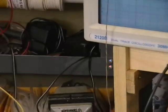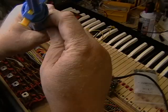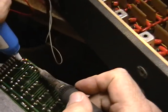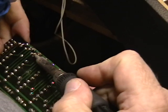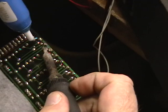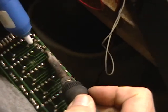I don't have five and six. Since in a flip-flop IC, current for the collector equals beta times IB, and since the oscillator works when we have nine volts on it but not on six, that seems to indicate that something happened in its old age to the two transistors. Very possible — it's only 40 years old. These are NPN, so we're going to replace them, just to see if the oscillator kicks in.